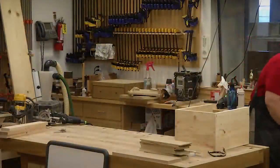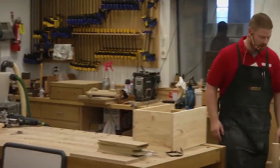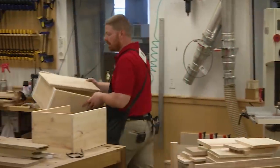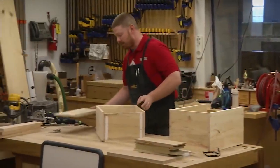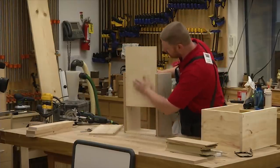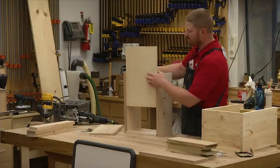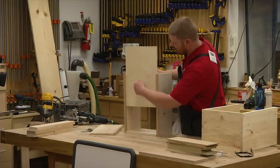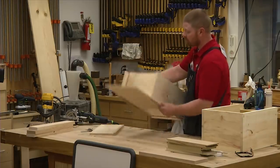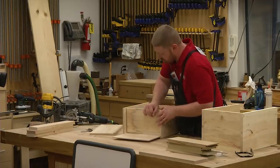Now, the box I did first, which I think I have the remnants of here, actually has a slide-in bottom that's not trapped in the back. So this bottom is free-floating. It's going to be loose in the back. To keep this from sagging in the back, I might have to put a screw here, or because it's a plywood bottom, I could also glue when I put this back piece, or the back of the drawer, down.